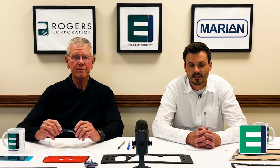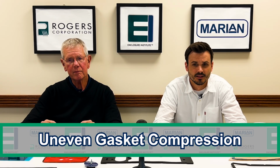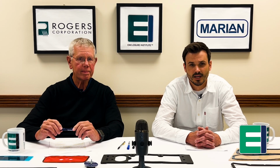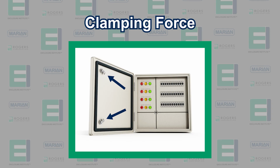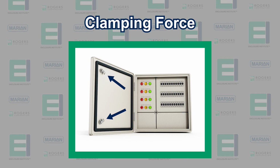Another problem in gasket designs has to do with uneven compression of the gasket. If compression of the foam is imbalanced, the area of the gasket that's compressed the least can be susceptible to pressure leaks. Whenever possible, ensure even compression during installation. For example, tightening bolts in an alternating pattern can prevent uneven loads. When the enclosure design includes a hinged opening on one side, consider adding evenly spaced clamping forces around the non-hinged perimeter of the encasement to keep the compression even.